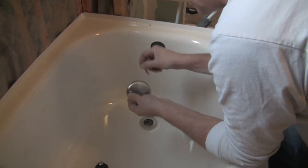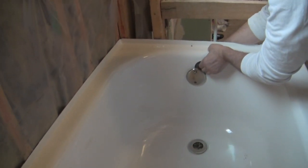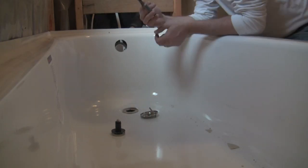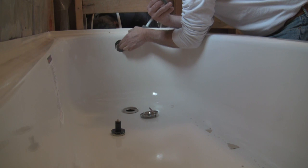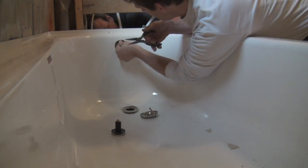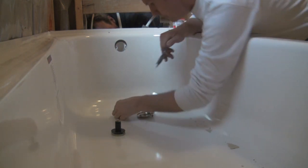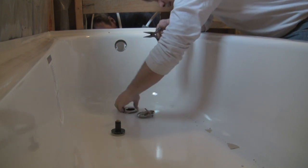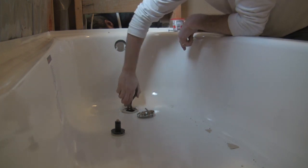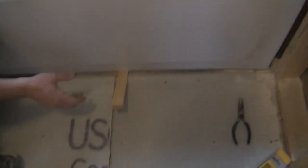Basically I want to tighten both of these at the same time. I've already got the plumber's putty set down there. So basically I need you to lift it from the bottom. Tuck the plumber's putty under the lip again — we'd want to do this without any leaks. You can come over here and lift this end; we're just lifting it like a quarter of an inch, not much at all.